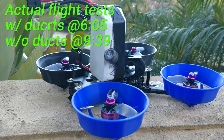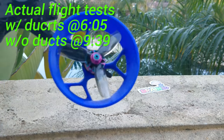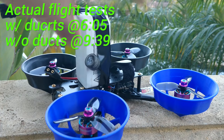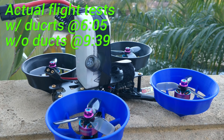If you've been around the hobby a bit, you know that back in the day we had quads that would just vibrate themselves up into the sky. Based on what I was hearing, seeing, and feeling in the quad, my direct observation, I don't believe that's what it was. People were even debating whether these ducts even work like ducts, which I agree — these are not perfect ducts. There is spacing between the prop and the duct, and you don't get the full benefit of having the duct with that spacing. But you can clearly see that ducts do something even when they're sloppy and not perfect, especially on tiny whoops. It's just a single data point to show that it's not nothing.